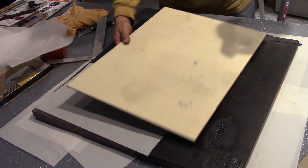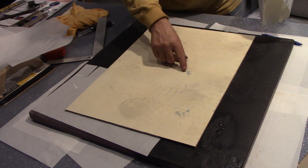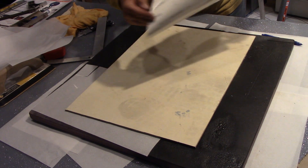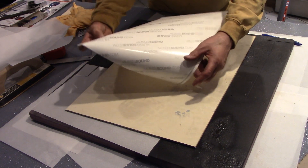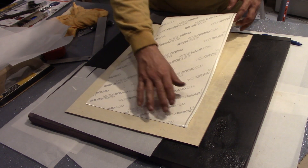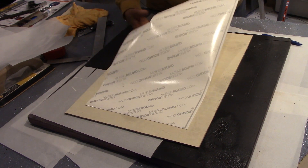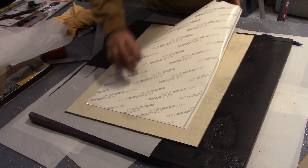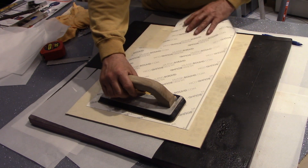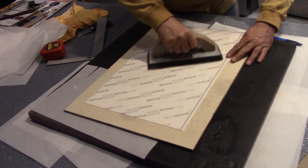Let's say this is our piece of wall here. You see how, even though this is not sanded, it's got a little bump there — this stuff, it doesn't matter. It's got absorbed, so you can have some imperfections on your wall. When you're putting it on your wall, just get a corner stuck first, because if you need to reposition, everything won't be fully matted down. What I've done — once I get it in position — is just use a grout float and go ahead and smooth it down. That seems to work well.